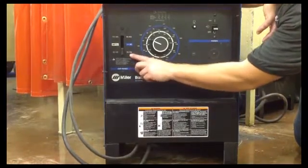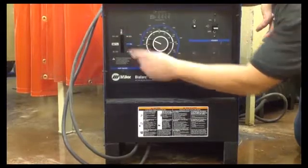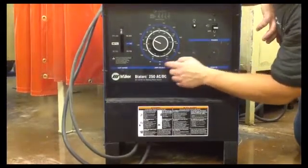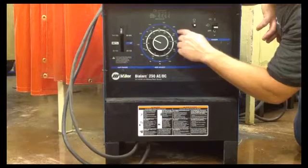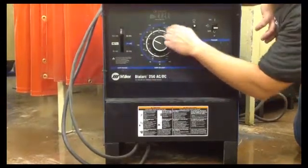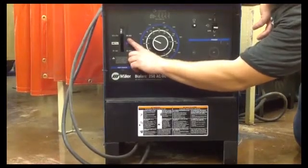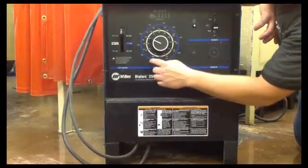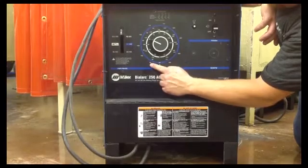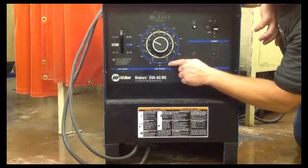Here's going to be 35 to 155, and 90 to 265. What that means on the dial is that you're either going to be on the outside numbers on the blue circle or the inside numbers on the blue circle. If you're at 90 to 265 amps, you're going to look for 90, which is on the outside of the blue circle, all the way around on the outside to 265.